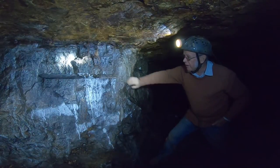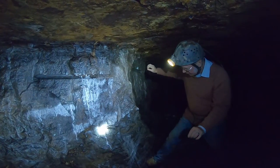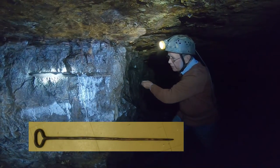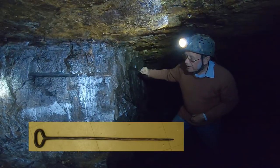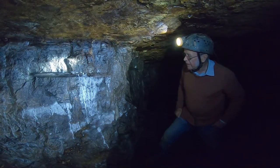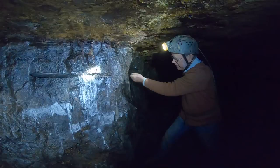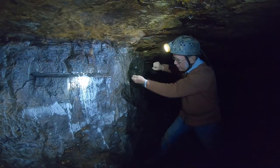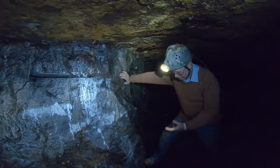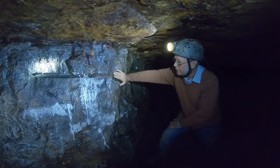When sufficient was put in, the hole had to be stemmed using a long thing called a pricker — a long tapering copper rod. The pointed end was put into the hole and pushed in, positioned so that the end of the pricker passed into the gunpowder. The next job was to stem material back into the hole. Using the pricker as a runner, the stemmer — which had a half-round cut out of it — ran on top and you would stem the hole quite hard, using mud, drillings, fillings, whatever, to create a solid filling of that hole.